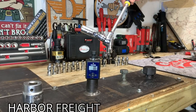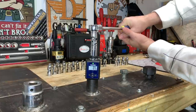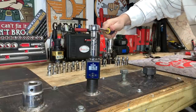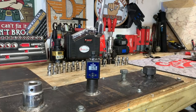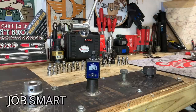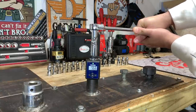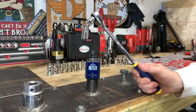Here we have the Pittsburgh Professional from Harbor Freight — no play before starting. Taking it to 62.5 foot-pounds: we hit 63.9 foot-pounds with just an ever so slight amount of play. That's your Pittsburgh Pro from Harbor Freight. This universal joint is the JobSmart from Tractor Supply — before we even get started, there's quite a bit of play. Right on 62.5, and as expected, it's just as sloppy as before.